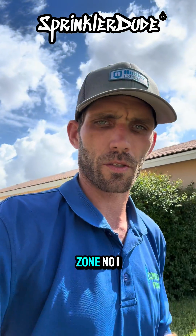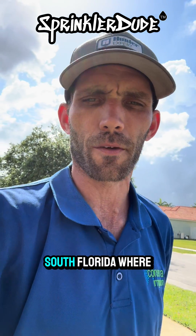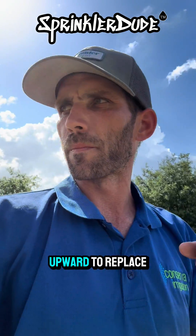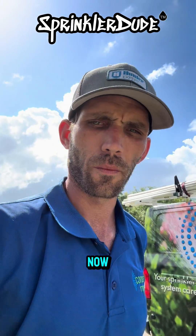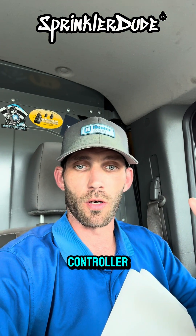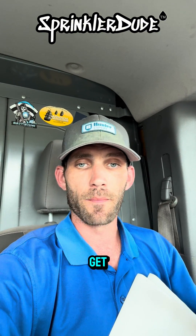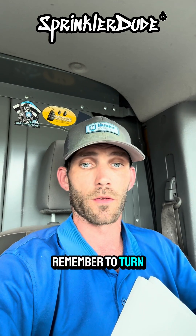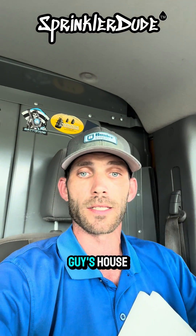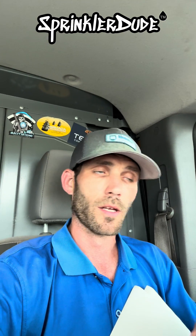He says he used to live in Bradenton, Florida, and when he turned on zone one it said number one on the controller and that zone came on. That's because he used to have a digital system before he moved to south Florida where all these analog mechanical systems exist. I'm willing to bet he'd be more interested in upgrading to individual valves than replacing that indexing valve. The conversation went well — the customer is going to upgrade the indexing valve to four individual control valves along with a digital controller. He likes the idea of going outside and adjusting his times from the controller, so he'll also get a rain sensor. We're going to move some of the sprinkler heads out of the areas spraying the house into the turf, and replace those rotors in the front yard with MP rotator nozzles so it doesn't blast his house.